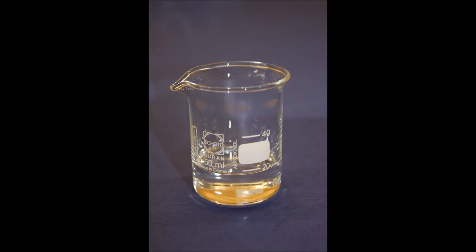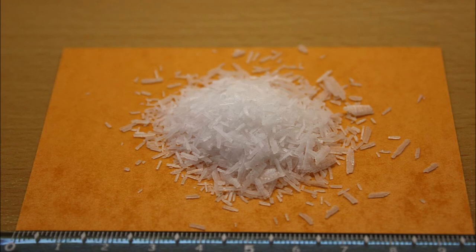Polyethylene glycol is a synthetic wax. At low molecular weights, referred to as PEGs 300 to 600, it's a liquid. PEGs 1,000 to 1,500 are gels, a bit like petroleum jelly. And at higher molecular weights, it's a solid wax. Unlike true waxes, PEG is soluble in both alcohol and water. The PEG conservation process involves submerging the cleaned object in water, a biocide, and a low percentage of PEG solution. Sometimes the tank is heated to improve penetration of the PEG into the timber. Over time, the percentage of PEG to water is increased, and the wax slowly permeates the wood, filling the cellular cavities in the decayed timber, displacing the water.